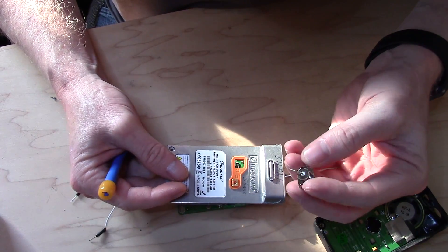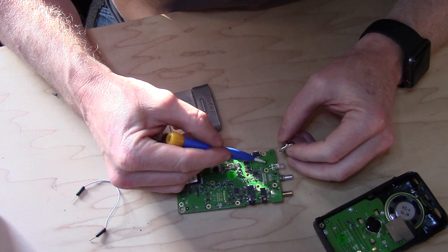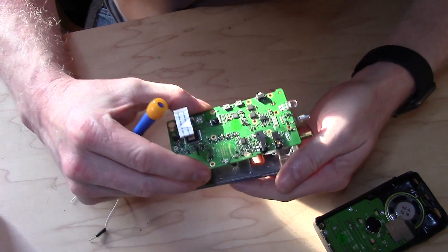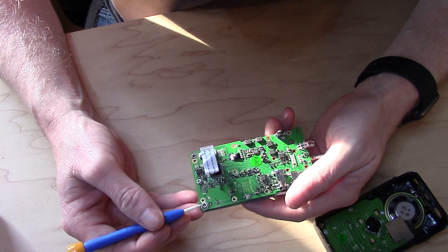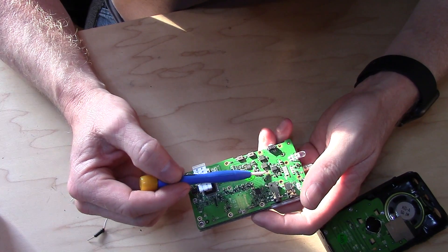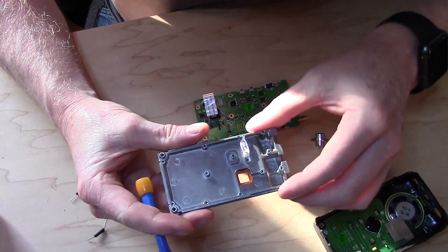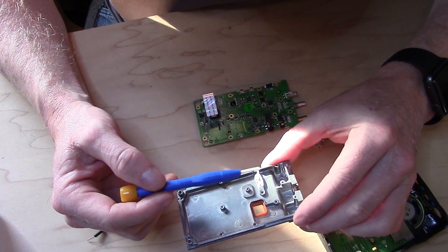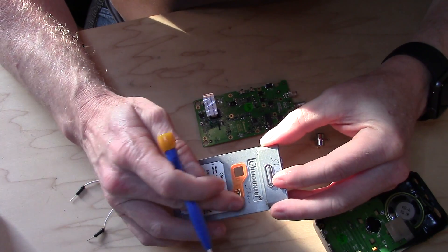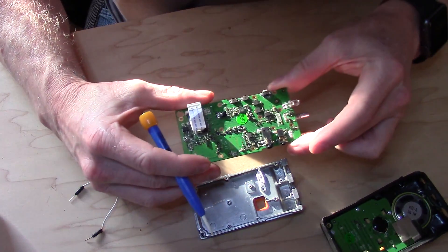When you're pulling out the board from the actual case, a couple of things to note. This part is actually soldered to the board. It's way easier to desolder this first and then take the screws out to give you a little bit more room - this will actually come up but it's a fairly tight fit. You can see these are really tight tolerance holes that hold on these posts. There are a ton of screws. Two of the different ones will be for these heat sinks - these are the main amps here on this side of the board and on the back side. There's a little bit of thermal grease on that bar. The ground actually connects directly through, and there's a screw in each one of these that you need to remove to get this out.